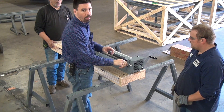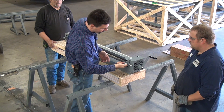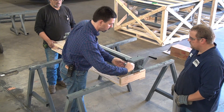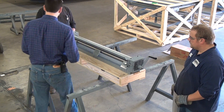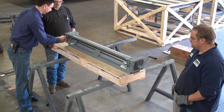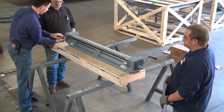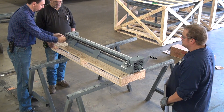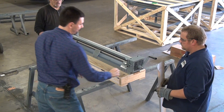But I don't go straight to one. I overshoot and then come back. I'll do one, two, three facets and then back out two. This is just to load up the adjusting screws so I get a good measurement. And again on the other side, I'll back it out one, two, three facets and then take two back out. Use these locking screws against the flat face so your setting doesn't move once you're happy with it.